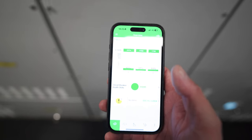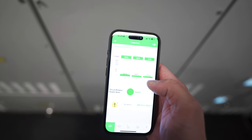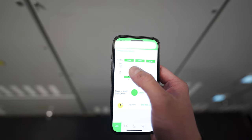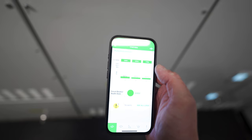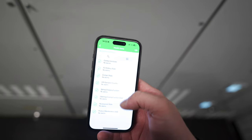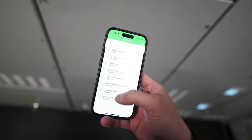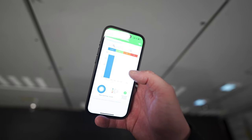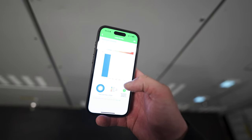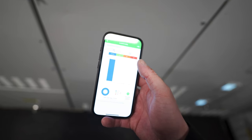And there we go - so now we're on the overview page. You can see here we've got L1, L2, L3 with the different amperages on each phase. L1 is pulling 232 amps and then L2 and L3 are sitting around 170 and 190. Down here we've got the circuit breaker health state - this gives you loads of information: control units, TCI battery, contact states, opening and closing function state. You've also got the load profile over time - you can see it's been less than 50% load for pretty much all of its lifespan, which is pretty cool.